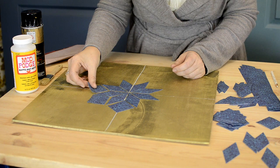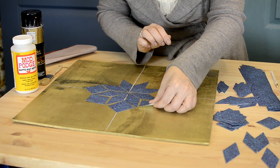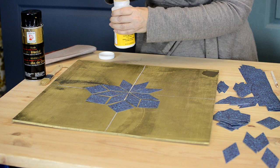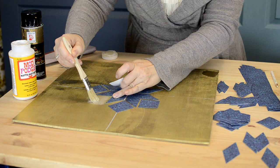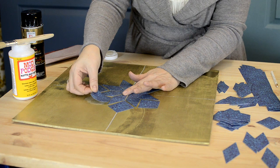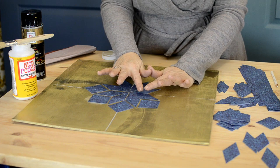If you want to make sure the marble is going in one direction, lay it out the right way and make sure they're all pointing towards the middle. Once I did all that, I left them in place and started from the center — you can start wherever you feel comfortable. I just did a small section at a time, laid the mod podge down, and made sure to get all the corners. It doesn't have to be perfect because we're putting a heavy duty layer of epoxy over the top. That's what's going to make this paper into a surface you can put glasses and books on and use it as a real serviceable side table. So do that all the way around, starting at the center.